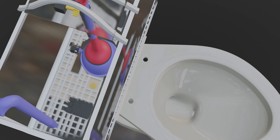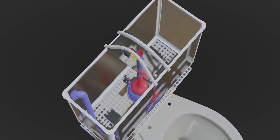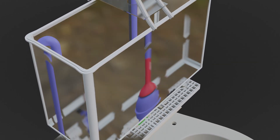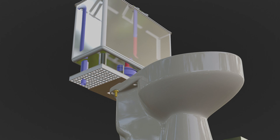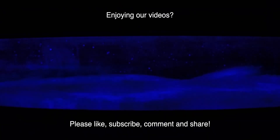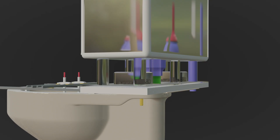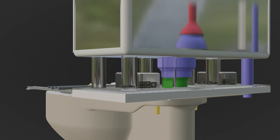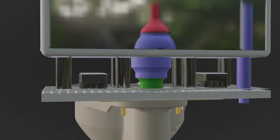While this design had some benefits — like holding our electronic and some mechanical components, and being a fixture technology platform that could move to most any of our fixtures — it had its own design flaw: gravity. Our tank will hold between six and seven gallons of water and could easily weigh 60 pounds. Elevating the tank from the bowl affects the combined center of gravity, and not in the right direction. While seeing the water flow through transparent tubes from tank to bowl is an important part of this system and our videos, with all of these separate components, it was becoming impossible to guarantee the stability of the combined structure.